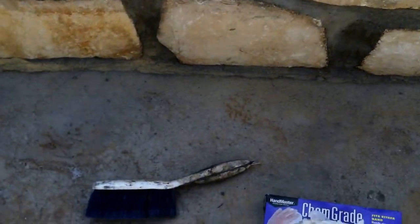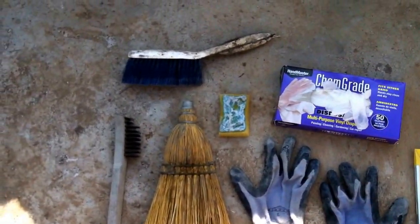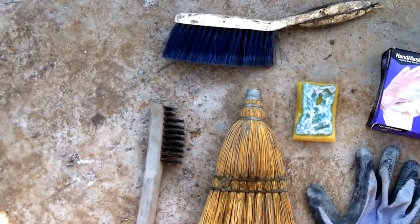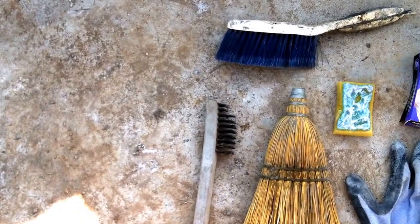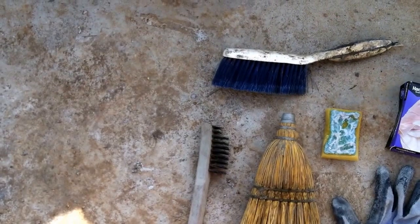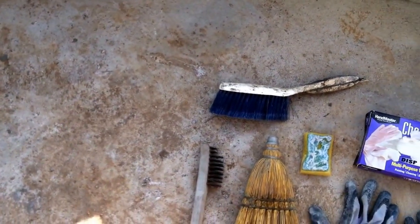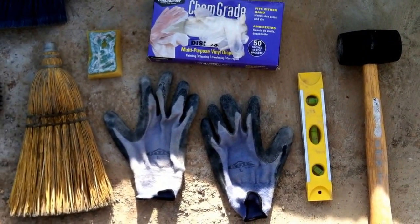We use these tools right here. A whisk broom is absolutely essential — once the concrete has hardened sufficiently, go in and whisk it, and it really makes a difference. The coarse wire brush is important because you need to knock off all the splashes on the face of the rock. Try not to hit them when they're still too moist, because they'll just smear. Wait until they're hardened up just a little bit and you can flake them off — it's much easier. Of course, clean the area before you do it.